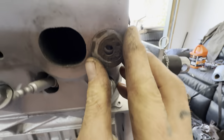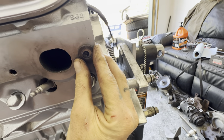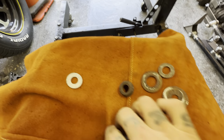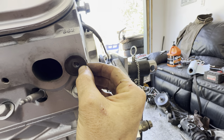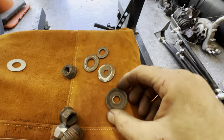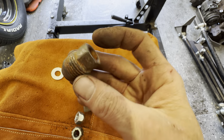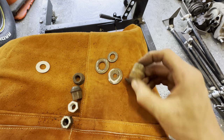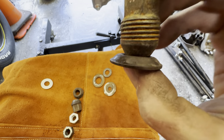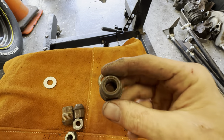For hole size, you don't want to be fighting the hole and you don't want to be ruining your aluminum — just find one that's the perfect size to give you full access to the steel stud and not too much aluminum exposure. It doesn't have to be perfectly flat. For the nut, you don't want it too deep because the wire will just stack up at the top and not reach down to the stud. If you've got a washer, you can weld around the outside edge to the bolt and still get good purchase.